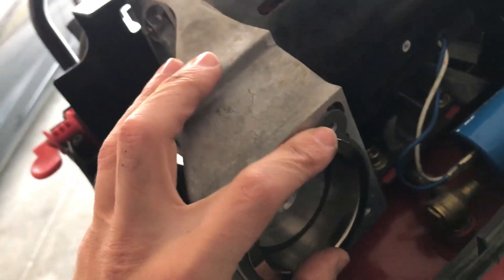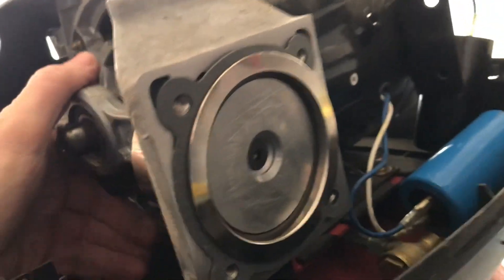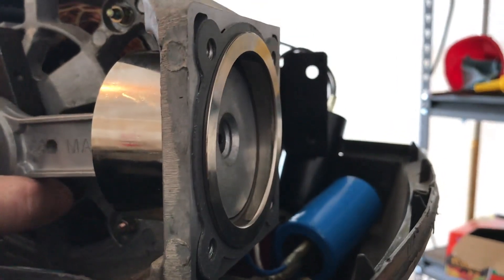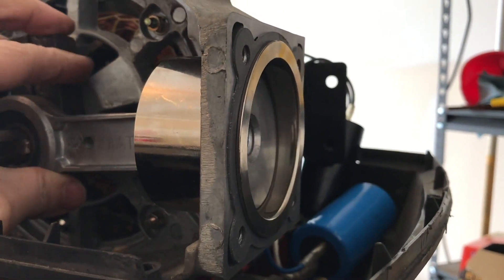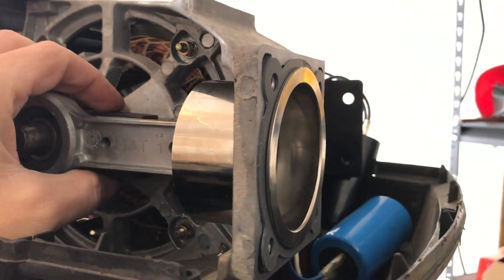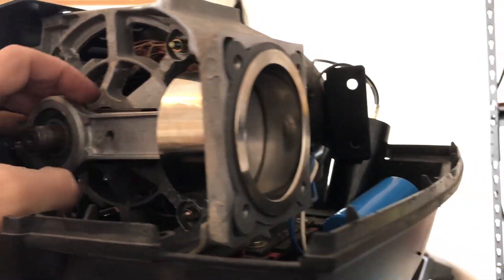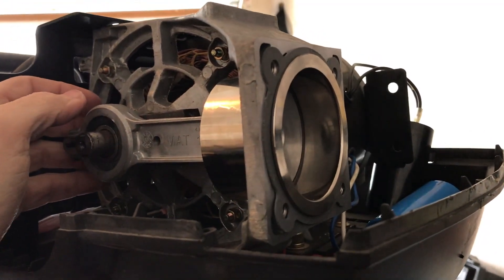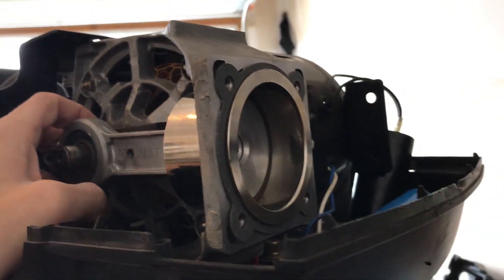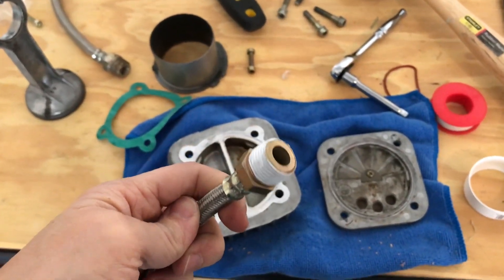We're in — need to get the bolts on there. The piston — see that angle — that's why it needs to have that soft metal lip, so it can bend like that and still maintain a seal. Basically every air compressor I've seen with an electric motor design like this functions that way. Very few have a straight up-down piston. It's more complicated, but this works fine and the parts are cheap, so why not.